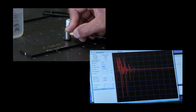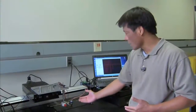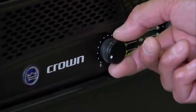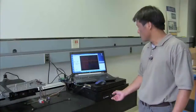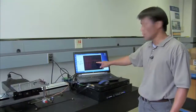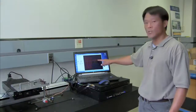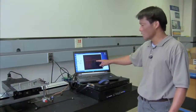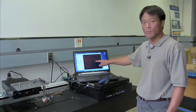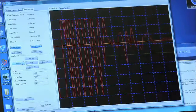and then defect there. So now we have the transducer with the solid couplant membrane mounted to a voice coil motor, and that will produce the signal that was shown previously, but instead of applying fingertip pressure, now we are modulating the transducer assembly electromechanically, and that's shown here. So we're getting ultrasonic coupling to the transducer solid membrane.